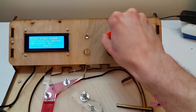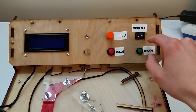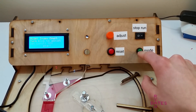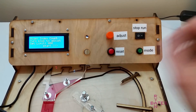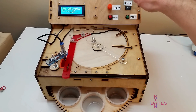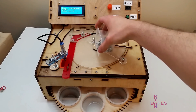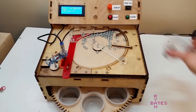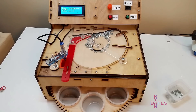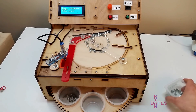I rewrote the code for a 4x20 LCD screen, replaced a potentiometer with a rotary encoder, and added some extra counting modes to the machine's functions. Basic use remains the same: setting the desired part count is done with the rotary encoder, and triggering run will start the machine. When the set count limit is reached, the machine indexes the cups, and the cycle repeats until all 8 cups are filled. There is also a mode that will just count indefinitely — this can be used for inventory reasons, but was really made to check the machine's accuracy by doing repeated counts and mapping out those statistics.